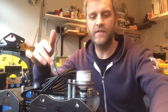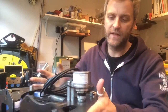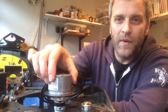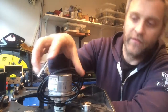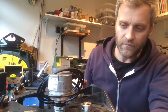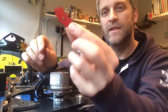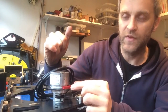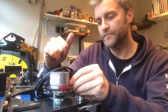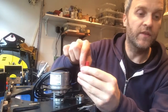That's gone together pretty well. I made these standoffs out of some 12mm aluminium tube - half-inch tube - with 8mm bolts going through the middle to hold it in place. The encoder lines up nicely through the bellows coupling. The bellows coupling keeps the encoder from taking any side loads, isolating it from the mechanism. The encoder is held in place the same way as on all the Mantis axes - these little machined clips that go into a slot around the encoder. There are three holes around the edge of the plate which need tapping to M4, then three clips go on and clamp down to lock the encoder in place.